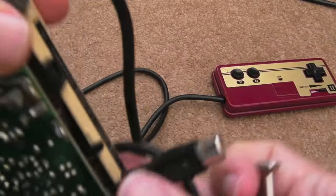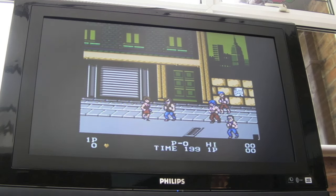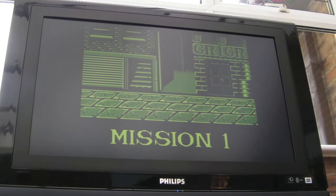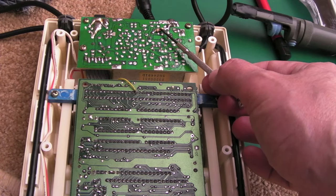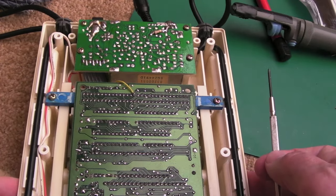In the next part I'll swap out the resistors and put a proper connector on there — for the moment it's just a fly lead out the back. Fixing that RF connector made a big difference to the picture. It wobbles slightly at the top — the sync isn't brilliant — but it works okay. Colors are pretty good. It's what you'd expect for composite, just a bit blurry, but considering these aren't the right-size resistors yet, it's pretty good. I've now swapped in a proper 120-ohm resistor — it was working okay with the 150-ohm but let's get the right components in there.